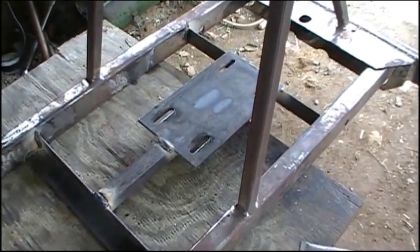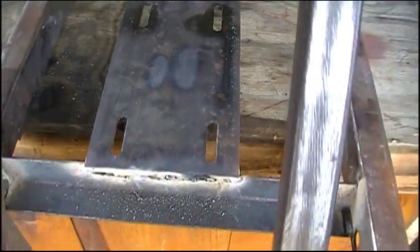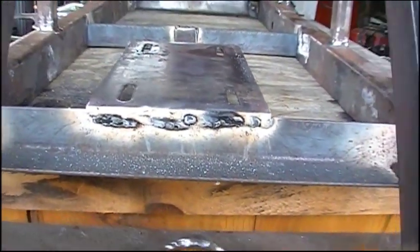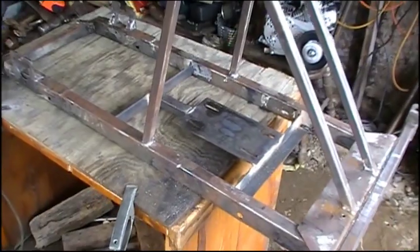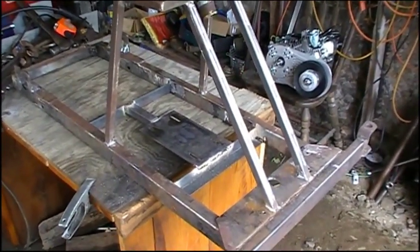So now you can see we've got it firmly welded into place. It's still really hot — I haven't cleaned any of the slag yet, which you can see there's plenty of. Some welds look better than others but they're all structurally very strong. We did a couple welds and you can see the hot marks from the welds down underneath. The front weld didn't come out the best but it's pretty strong — I'll clean it up a little bit, but you won't see that so much so it's not a big deal. We're going to wait for this thing to cool off and test fit the motor one more time to check the clearances, and we'll go from there.